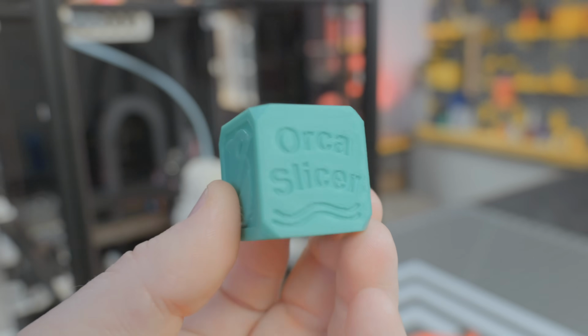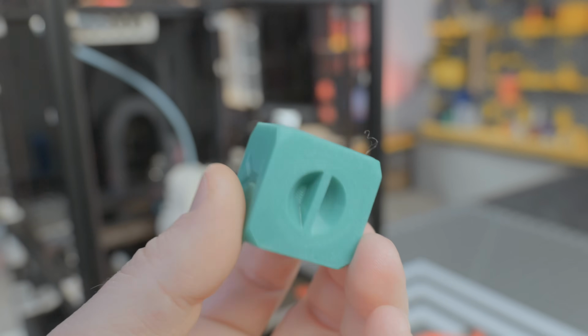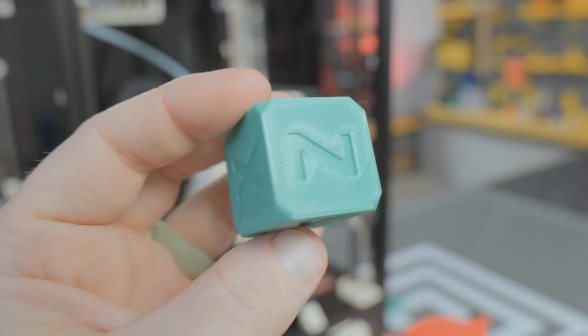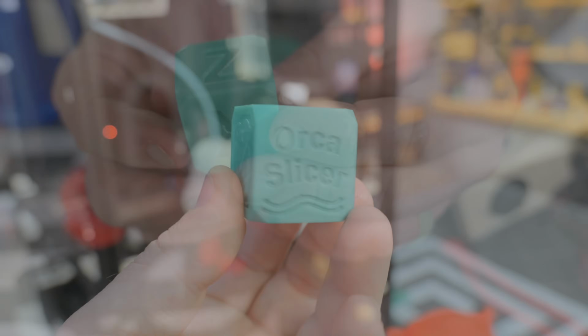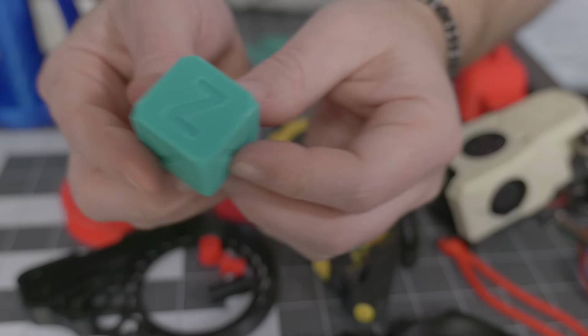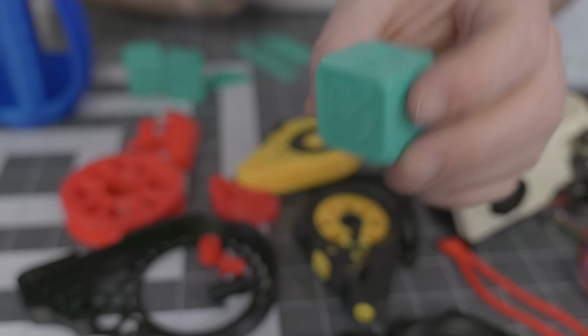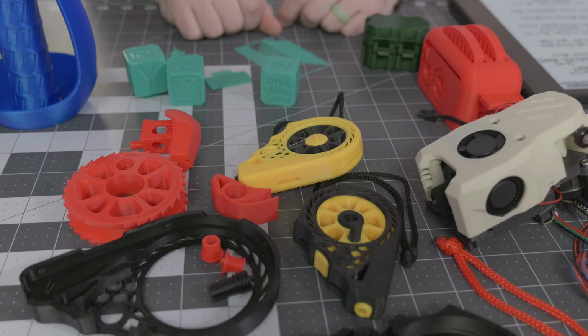We did some shake tuning. So we got the skin looking much, much better. And check out the bottom. It fits so well into here that when you screw it in, you can't even tell that it's in there. It's really just fantastic. So what a result. No more over extrusion at the top there. Just a really, really good looking cube. And like I said, one of the most rewarding things was getting something like this with this much accuracy out of a printer that you build yourself.